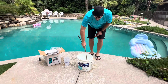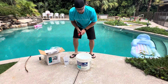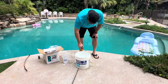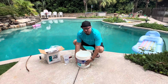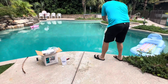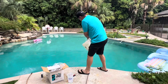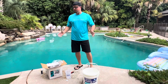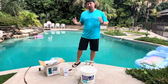It's not going to hurt you immediately, but I want to go swimming right after this. So that's pretty dissolved. We check the temperature again — we went from 88 to now 92, 93 degrees. It'll keep heating up as it goes; you can feel the heat from the side of the bucket. So then you're going to go ahead and just add that calcium to your swimming pool. We're going to repeat that a few times until we go through our calcium, and that once-a-year process will help your marcite or plaster finish last for years and years.